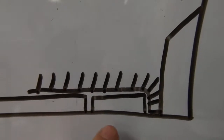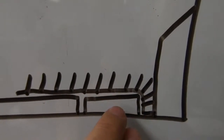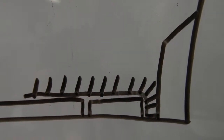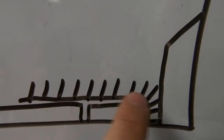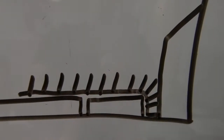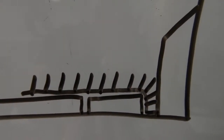This here is a scenario where we've created a gully spacing in line with the thickness of the material that we're using. By having a proper gully spacing, we can ensure that the trimmed edge of carpet is locked in place and will not come out when the customer vacuums.